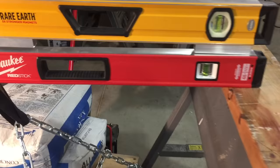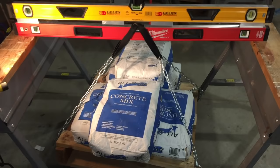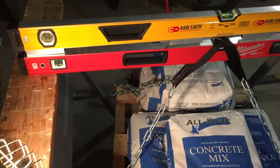It's a pretty simple but effective rig — we used a motorcycle jack to prop up a weighted pallet, and used straps and chains to center the pallet on the level. When everything was set with loaded weight, we'd lower the weight so it was centered on the level, then take measurements before, during, and after for a complete picture of level strength, elasticity, and whether the level returned back to flat.